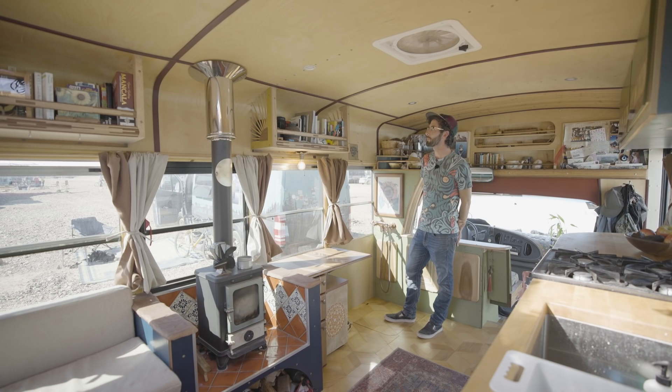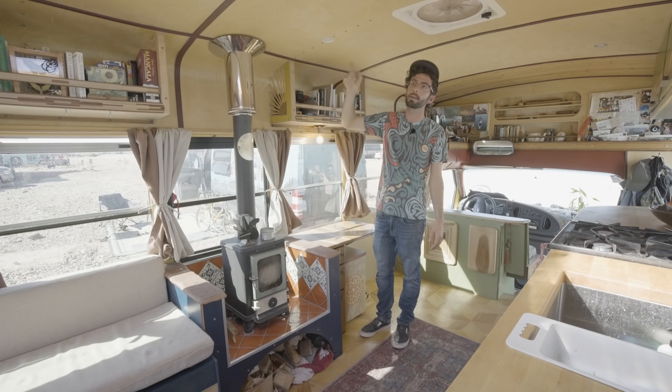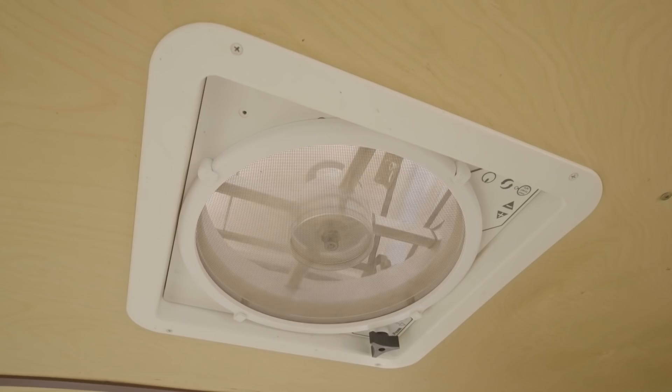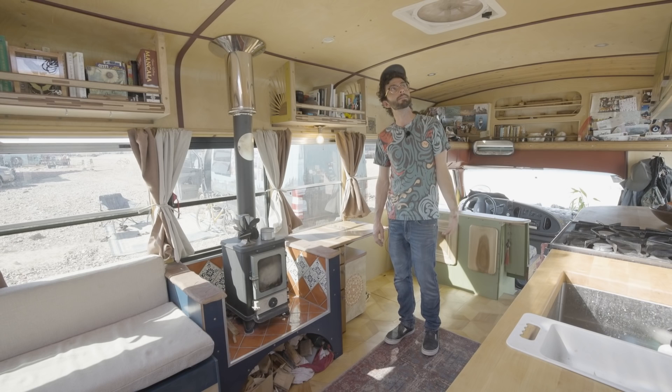Our floor is also birch — made of half-inch birch plywood that we ripped into six-inch wide strips. On a miter gauge, we cut 60-degree angles on both sides, which form hexagons and the flower pattern and the 3D cube pattern. They're all glued down to another half-inch of subfloor with an inch of insulation underneath. In our ceiling, we did these LED puck lights — eight of them in the ceiling and two in the kitchen and two in the rear. When they're all lit up at night, it's really beautiful and evenly lit. We've got a Max fan in the ceiling, and we went with the thermostat fan, though we've never actually used that feature.